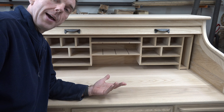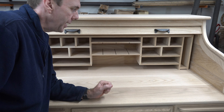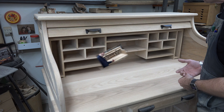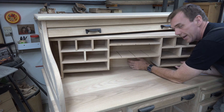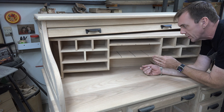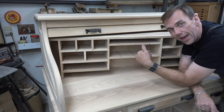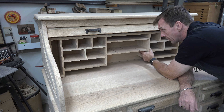To install the backboard, I'm going to cut it to size, put it in place, and use little brad nails to hold it in place. With that, our backboard is installed. I've nailed it in through the horizontal surfaces at the bottom to give it that extra support — nails along here, along here, and along here, as well as the perimeter around the cubbyhole carcass.